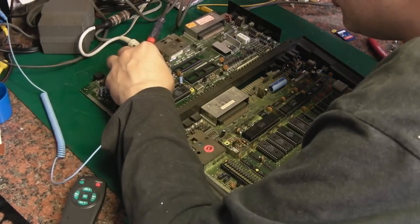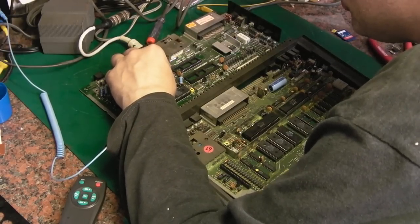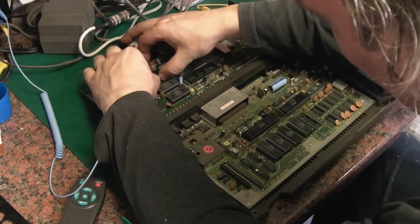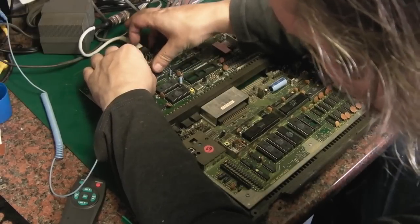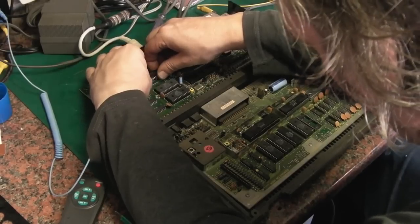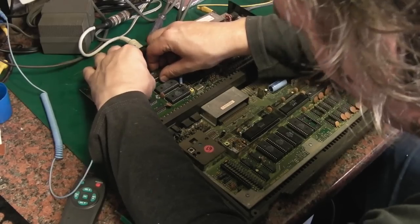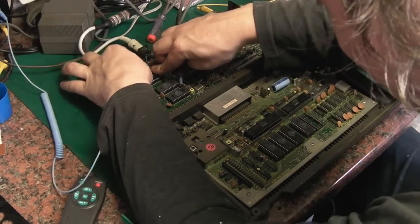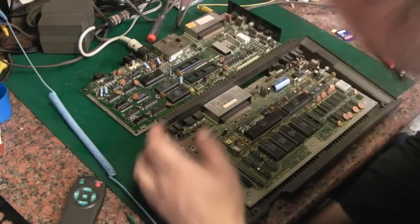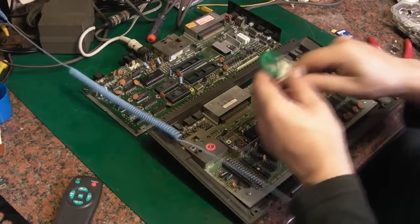There are modern replacements for this PLA, like there are for the C64's PLA. They aren't particularly cheap, but like I said, it's not the end of the world if you do need a PLA. I think there's possibly a couple of EEPROMs as well. I think that the OTP, the one-time only programmable ones, you may be able to use in certain circumstances. But there's certainly a modern plug-in replacement for that. Like I say, it's not particularly cheap, but it's not the end of the world if that IC goes. It's not like these two.